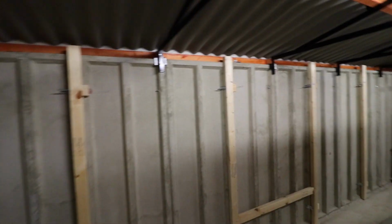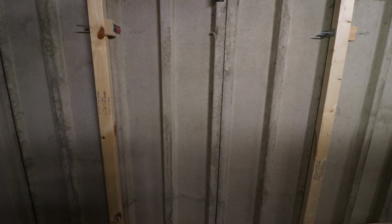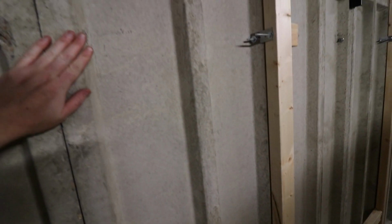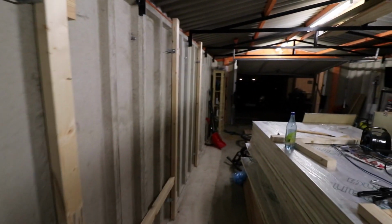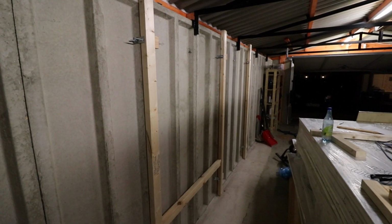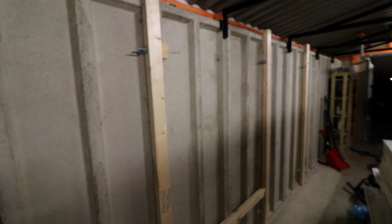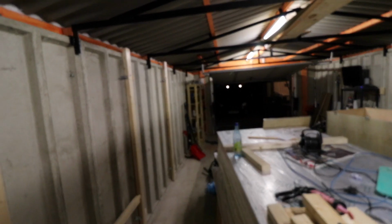So the idea is we're going to put some of this Kingspan insulation boards that we have here. We're going to basically glue them using some foam adhesive, and we'll just glue them on to the actual boards. And then after we've done that, the next stage will be just to screw some plywood onto the battens. That's what they're there for, so you can attach wood to the sides of the concrete panels, because we can't drill into this. The reason for that is apart from the concrete not being very rigid and strong, as you can see here, a bit of it's come apart and you can see the inside of it, but it's steel reinforced, so it's not easy to drill into it. So in the next video I'll show you the next step once I've put all the insulation boards in.